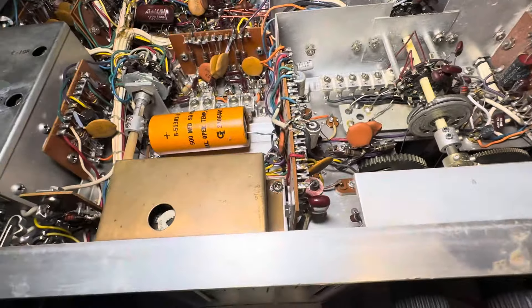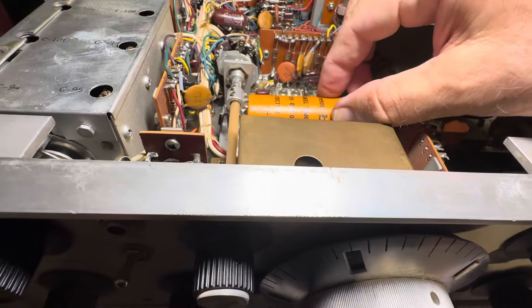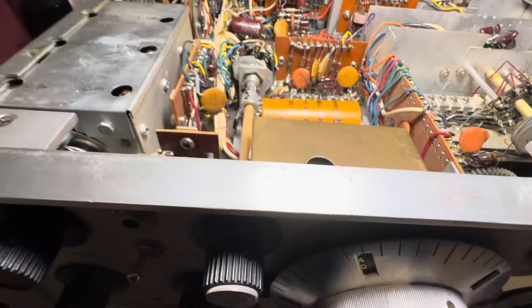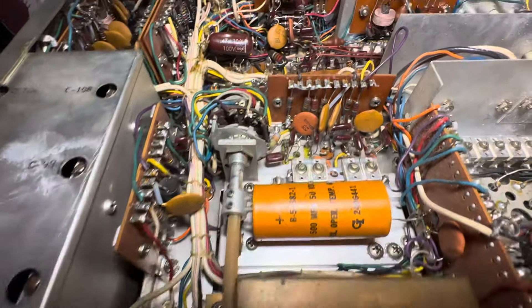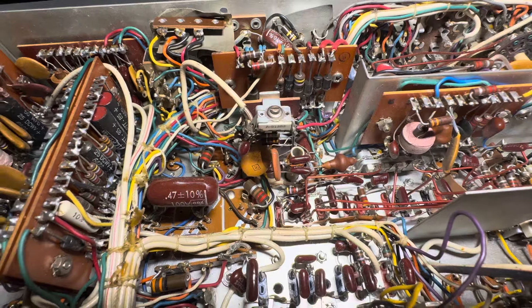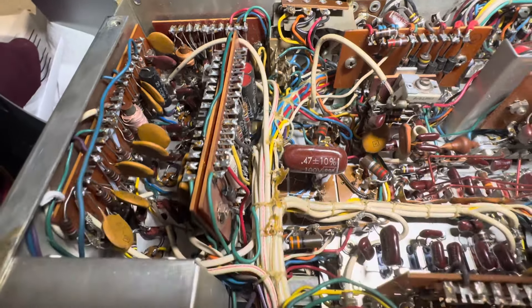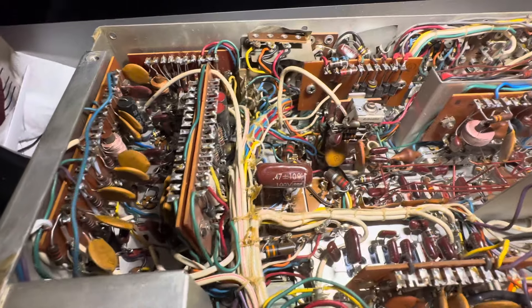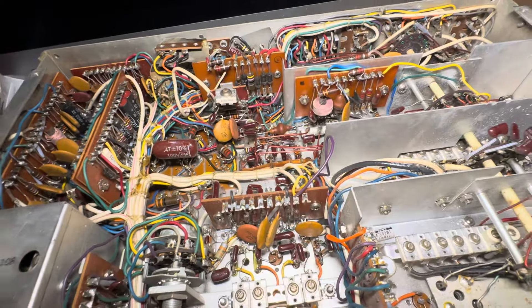This is a 1965 model, by the way. This is for the 12-volt power supply from AC 120 volts — this probably gets replaced. I've been running it on 12 volts off a small supply, so I'm not going to try the 110 yet. I love how this is made because it's using World War II type technology on the boards with point-to-point wiring. It's lovely — this is very serviceable.